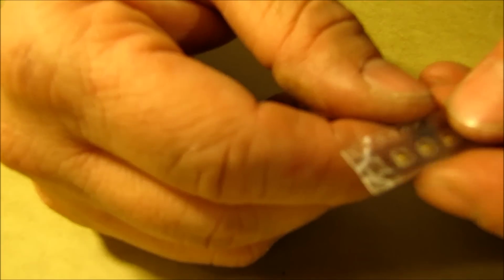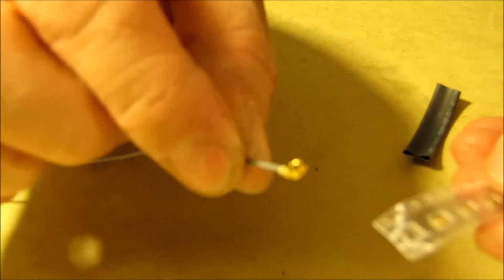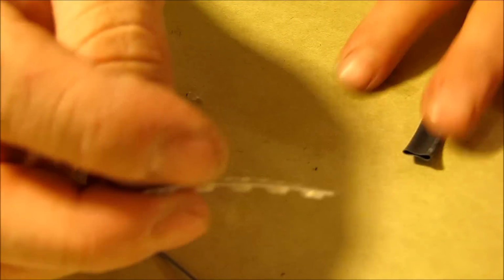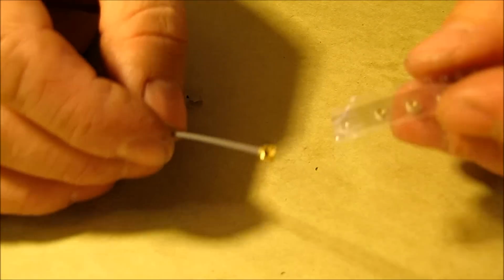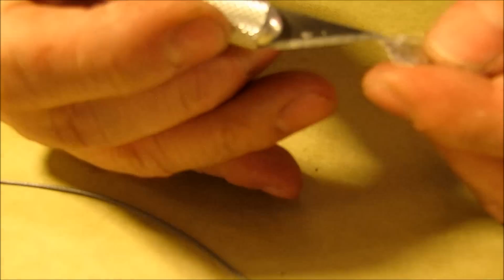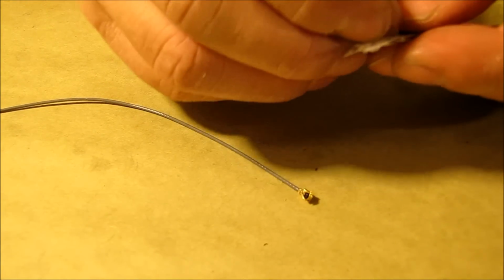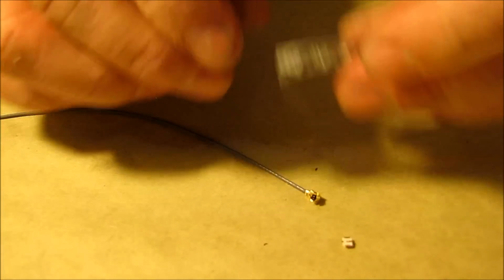And a word of warning, the first thing I did when I got these is I went ahead and plugged it in here to make sure, before I soldered it on, that it fit this. Well, when I did that, I destroyed it getting it off of this. So, I assure you when I post the link on here that the ones that I bought off eBay and the ones I bought off of Amazon here, this antenna, they fit each other. I didn't expect it to stick that well, but I destroyed it in pieces trying to get it back out of the little socket here on that. Go ahead and pull this back, dump one out.